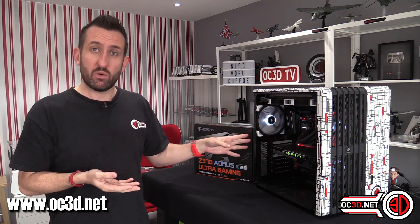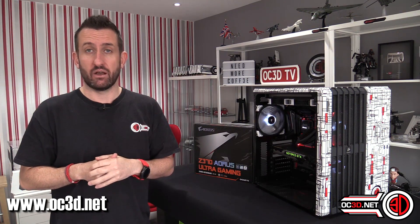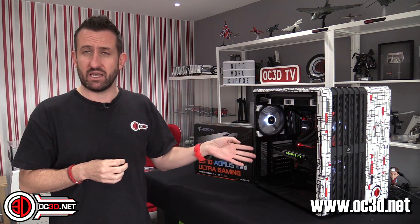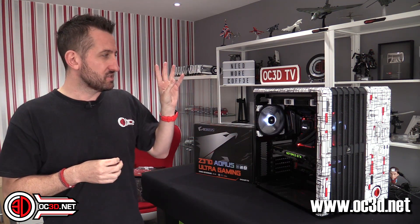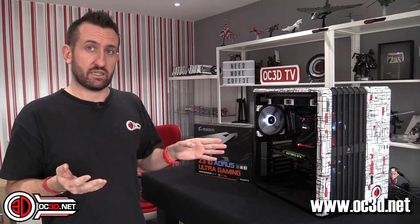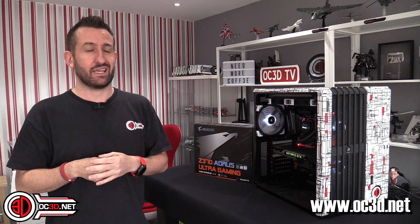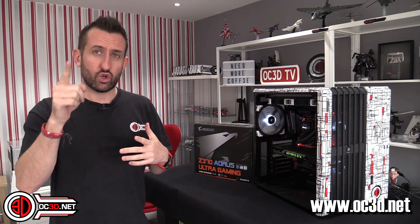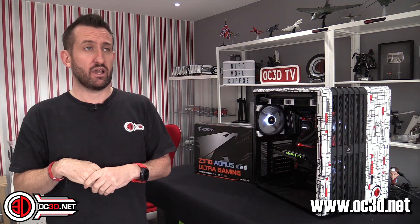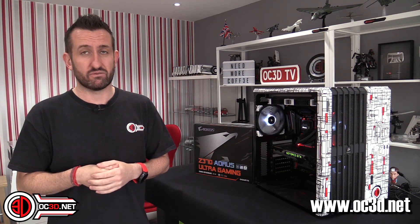All I know is, if you're looking to me and asking should I buy this board — if you want to manually overclock it, I probably wouldn't. I'd go and look at one of the others. The Gigabyte Gaming 7 compared to this is a much, much better board. There's just something not quite right about this at the moment, and the correspondence with Gigabyte has just gone quiet. If you're going to manually overclock it, I wouldn't bother — VRMs that hot for too long is a problem.